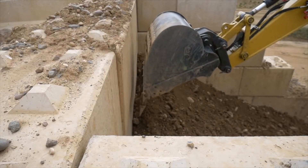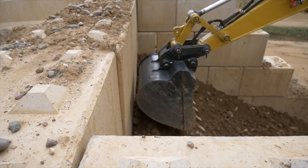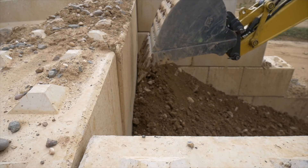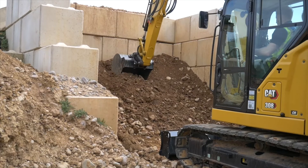When you've set that boundary, no part of the machine will pass through it until you track or reposition the machine. You'd use this to avoid structures out in front of the machine — maybe working up against walls like I'm doing here.